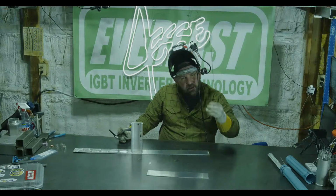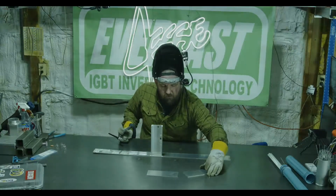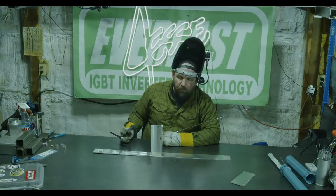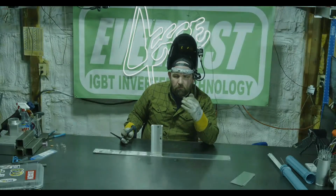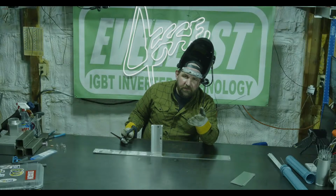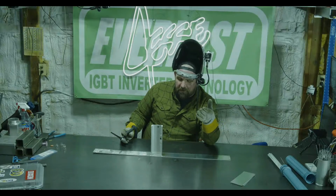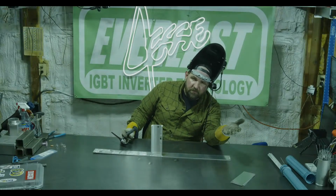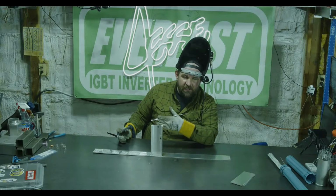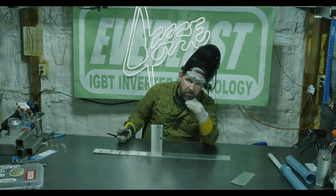1/8 inch tungsten is my go-to for aluminum. It's just from when I was working at a previous employer. I would run anywhere from like 90 amps up to like 280. So 3/32 if I had some, but constantly going from 90 amps to 280, I'd have to switch out to 1/8 inch tungsten anyway to go to 280 amps. So eventually I just stayed with 1/8 inch tungsten, period.